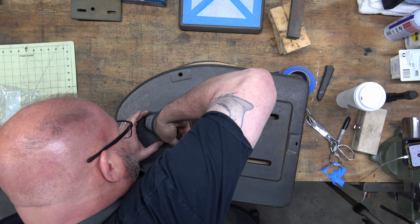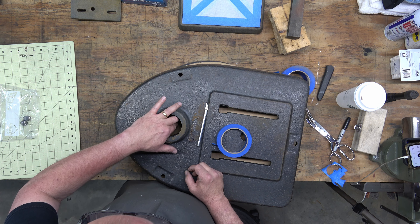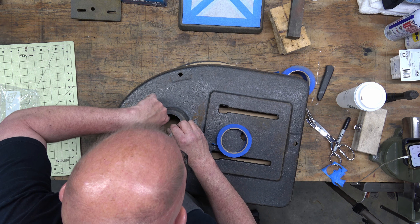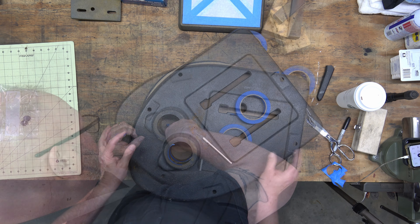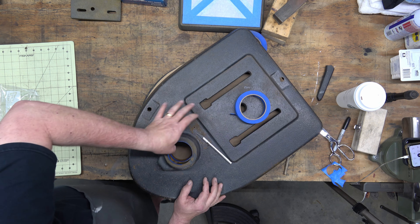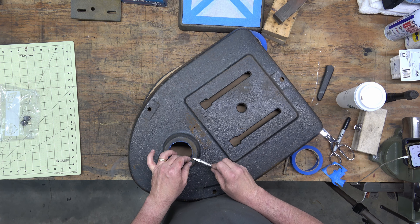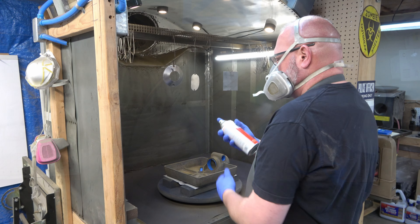Once I've got the end frames done, this is the floor base. It's got three bores inside where the column gets inserted, so all three of those bores are going to get masked off. I'm trying to use the minimum amount of tape necessary to mask the bore — I don't want the tape to rise too high or below each one of those bores because I want to be able to paint the cast iron between those bores. You can see all that rust that's still in there even after we've de-rusted this thing. When we go to paint that second color, we'll do some additional masking.